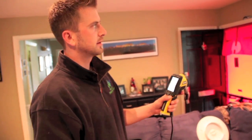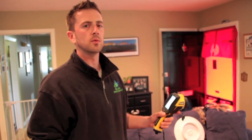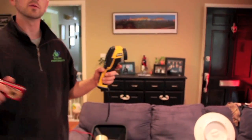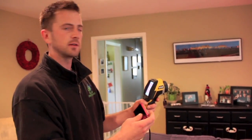Caulking the trim to the drywall will reduce the air leakage in the house. It doesn't necessarily stop the air from getting around the window, but at least it's not coming into the house. It's an easier, more cost-effective way to do this. I'm going to go through the house with the camera and find any places where there's air leaking in, take an infrared picture and a standard picture, and include them in the report for Kelly.